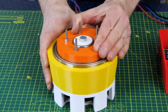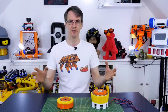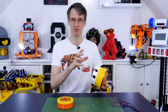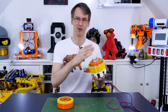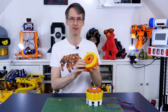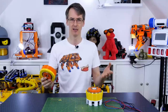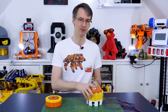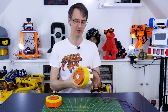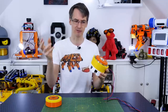However this one I can still stop with my hands so there's not much point in doing proper torque tests at the moment, at least with that motor driver. We do need to do some proper torque testing with a proper motor driver — probably an ODrive with an encoder on the back of the motor so it can actually hold its position. I'm not sure why the strain wave can be stalled with my hands using even a skateboard ESC whereas the cycloidal drive I couldn't. I think the cycloidal drive is full of bearings with hardly any friction and might be quite a lot more efficient than this strain wave — and they're both 10 to 1. If you think you know why that is, put some answers in the comments. It may be that when you try to stop this it flexes the flex spline in a funny way and causes the teeth to jam and creates some extra friction. Tolerances need to be a lot tighter on this and probably funny things are going to happen at different velocities as that flex spline flexes all over the place.